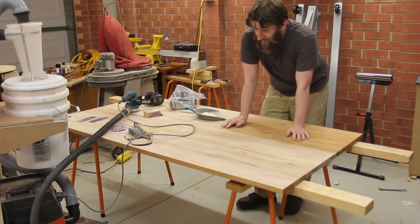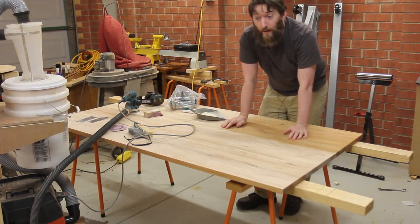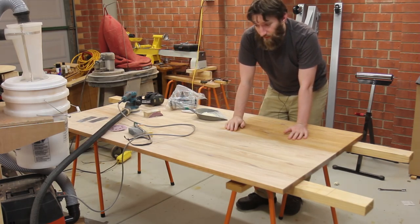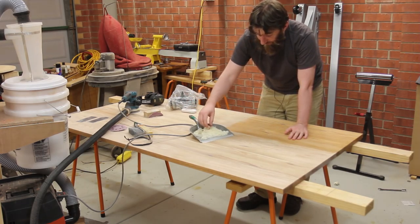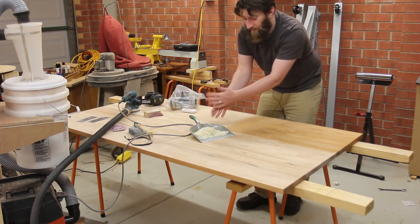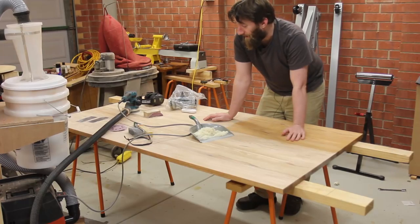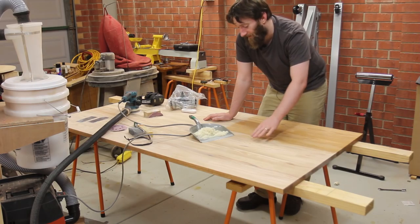As you can see I have been sanding this — I've sanded about three quarters of it. After scraping I've hit it with sandpaper at 80 grit. This is some, not all, of the shavings from the scraping, and as you can see, getting rid of that much just with the scraper before hitting it with the sandpaper means the sandpaper will last a lot longer. That being said, it is still important to change over to clean sandpaper — you'll probably go through two or three sheets to do something this size.